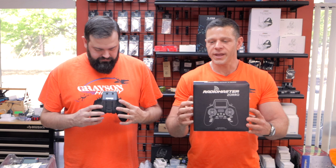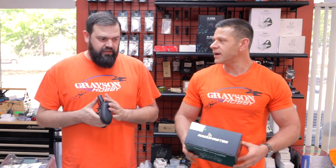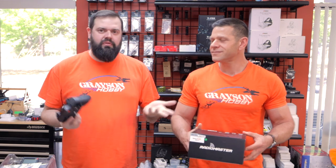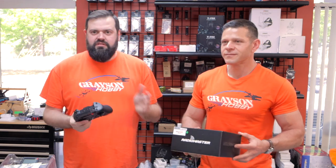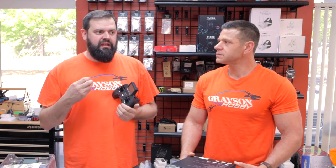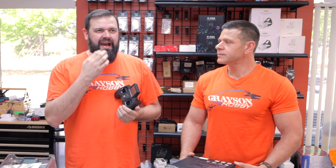There are multiple options of the Zorro. We have the 4-in-1, ELRS, and the CC2500. I would just not worry about the CC2500 unless you're die-hard FrSky D16/D8 only — don't waste your money, Radiomaster just discontinued it. Get the 4-in-1 module if you are new to the hobby, buying plug-and-play stuff, and you're not the type to jump on GitHub and update software every day it comes out.